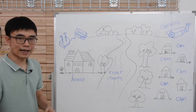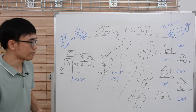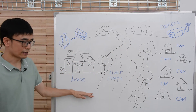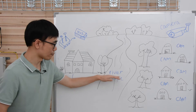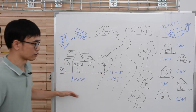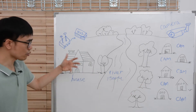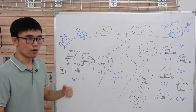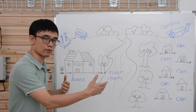Here's the real situation. The customer wants to set up multiple cameras at the other side, and he placed the NVR at the house. There's about 1,500 feet of river between these two, so it's quite difficult to wire the cable from the house to the other side. We need to consider whether we can use a wireless bridge. Usually the wireless bridge works in a pair — one transmitter and one receiver.